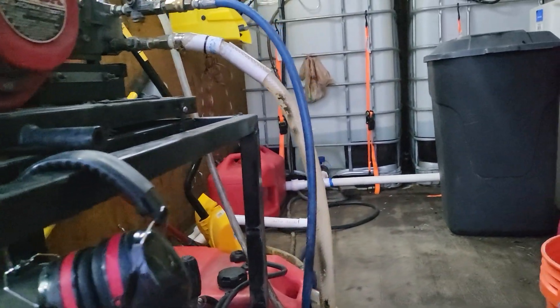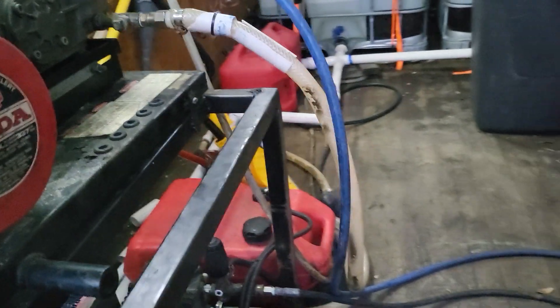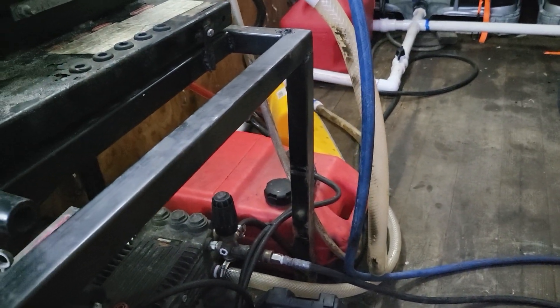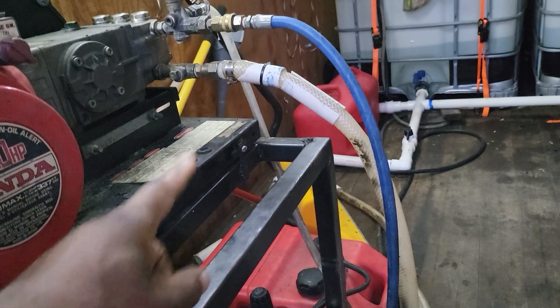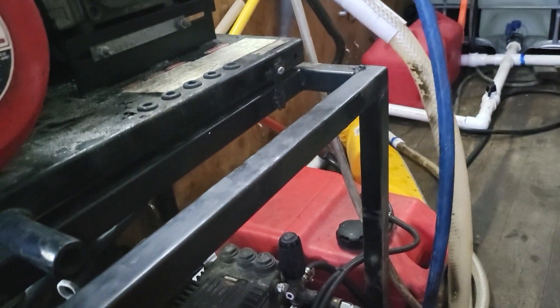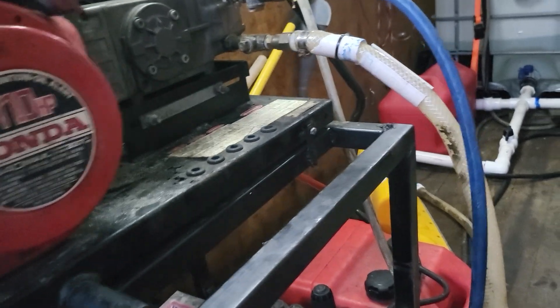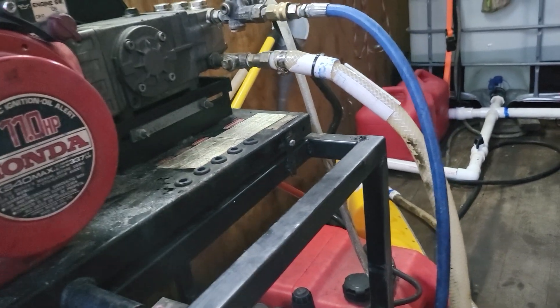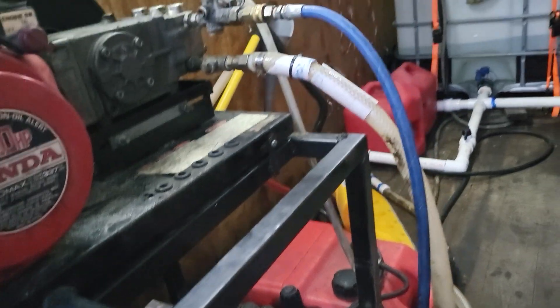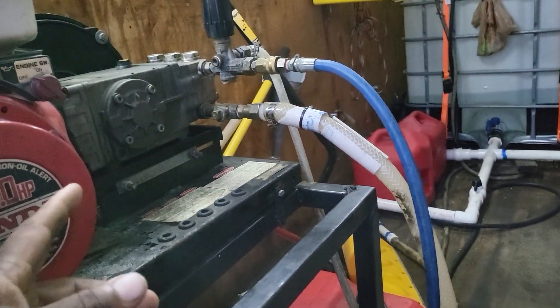You can do it — you just have to make sure you don't have any leaks. Especially in a box truck or trailer, you do not want leaks, so everything has to be tight. Also you've got to make sure you have a belt drive. Both of my machines are belt drives — all my rigs are belt drive. I see a lot of new guys getting gear drives and having issues pulling water. I don't use gear drives, never had one, and will never buy one.